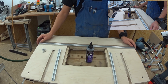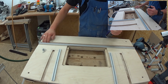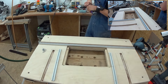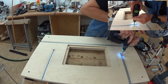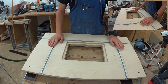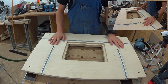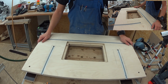Now the rails are finished. Before I screw them in, I use some polyurethane glue underneath to give it a really nice solid surface and to give the rails a bit more rigidity. So that's it. Now before I put it in the frame of my table itself, I will take my sander and clean up all the markings and straighten up the upper surface of the table, and then the next step is to put this thing together.